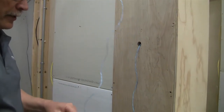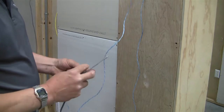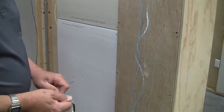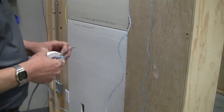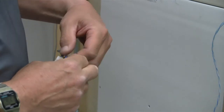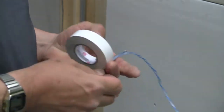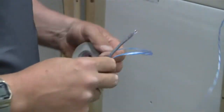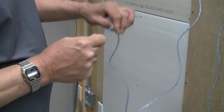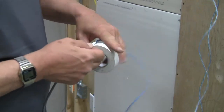and again you can do the proper tying procedure. In this case we don't have to be quite as elaborate, we have just one string or one wire going into the wall. So if we tie our knot there, let me grab a piece of tape. Okay, take our tape. Again, doing the proper pulling procedure. Tape our knot. Do one half hitch. Tape off the very end.